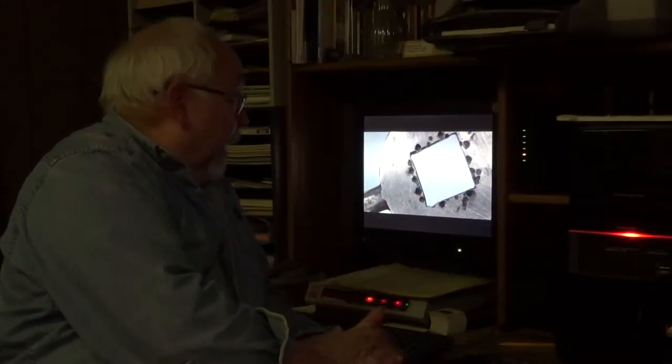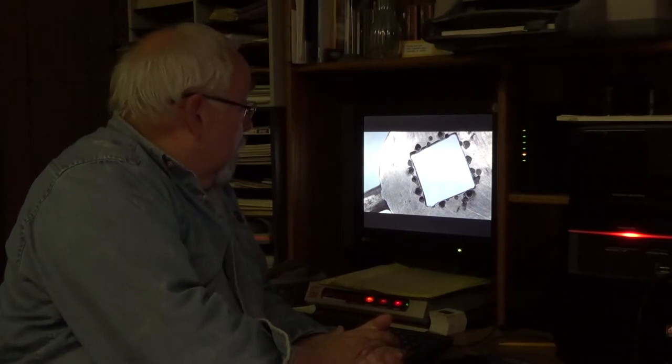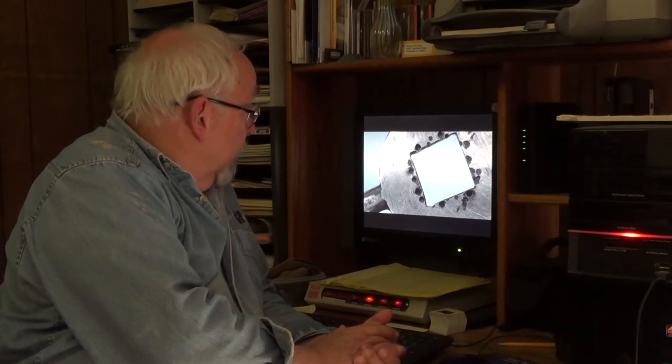This is the base of the hour hand, which some professional decided to take a prick punch and pound the living daylights out of, apparently to tighten up the square because they had destroyed the normal mode of attaching the hand. They tightened the square up and then peened the daylights out of the end of the hour tube to reattach the hand.